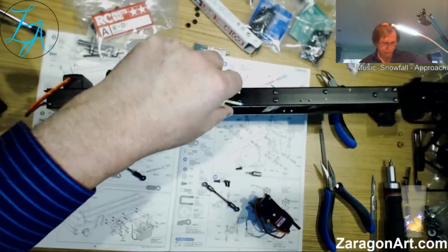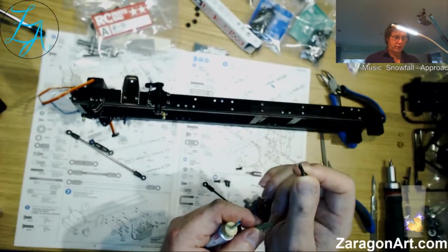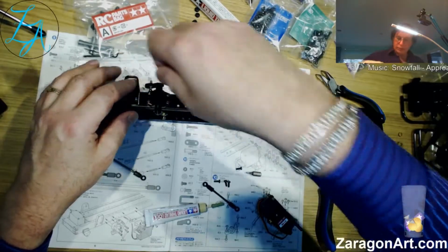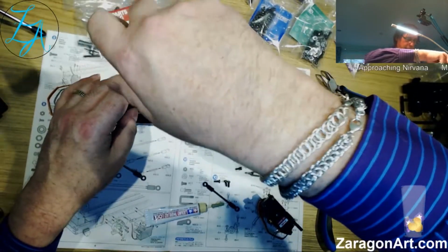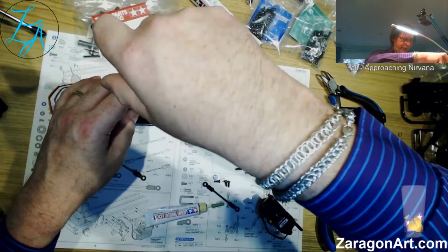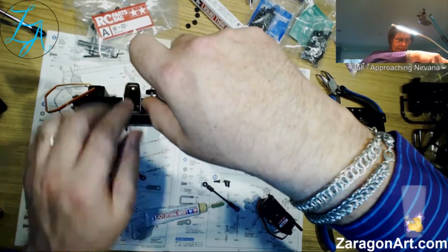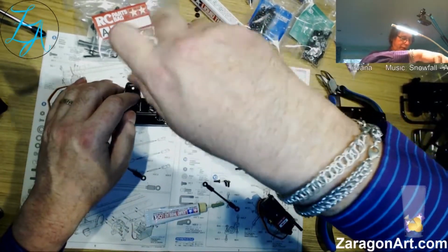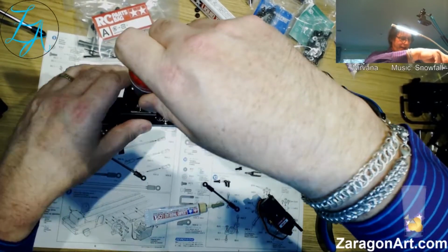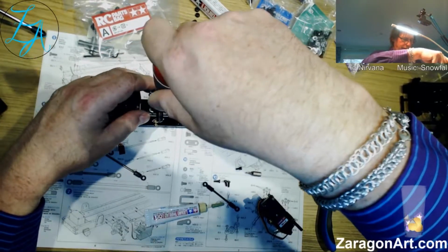There it is. I was looking for the top because I really didn't want this stuff leaking out, which is what it's just done. It will go all the way around the bolt, and it will still seal the threads. So as long as you don't put it so far up the bolt that it never comes into contact with the threads, because then it serves no purpose. But if you put it near the end, where it has to meet the screw thread, then you can be reasonably certain that it will do its job.